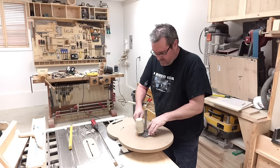Okay, now I've got it back together. I'm gonna try to put the blade on. Now these wheels have not been adjusted yet. They need to be lined up. Now these rods come through here and they do two things. They put tension on the blade by pulling the wheel this way, and also they'll be able to adjust the tracking. If you adjust one individually, it'll move the wheel like that, which will adjust the tracking. That's the theory anyway. We'll see how it works in practice.